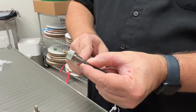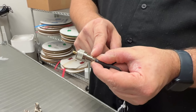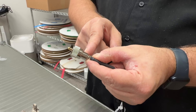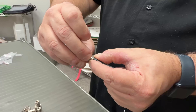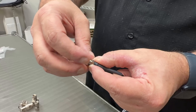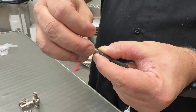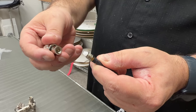This one completely locks into place so there are no torquing or torsion issues. The only thing to be concerned about is you have to be a little bit careful, like with your SMAs, because the tension is only about five or six pounds. So when you tighten it down with a wrench you can do that, but hand-tightening is usually preferred. It'll hold, but it won't break on you.